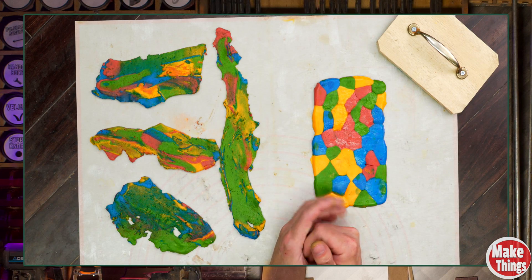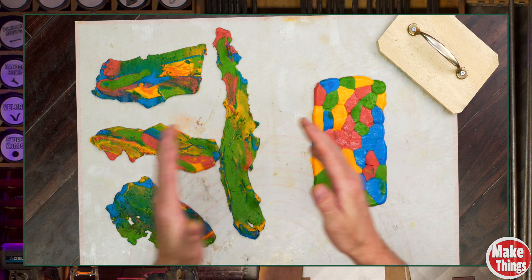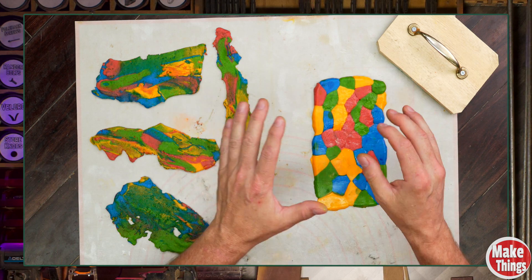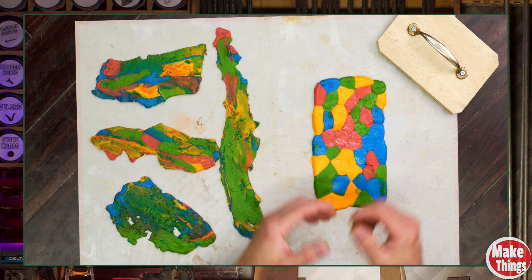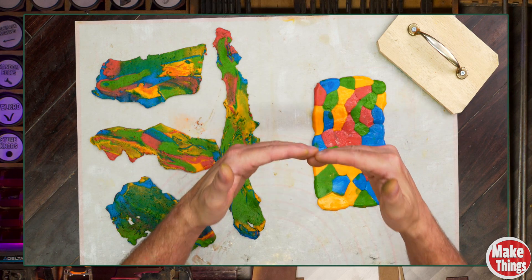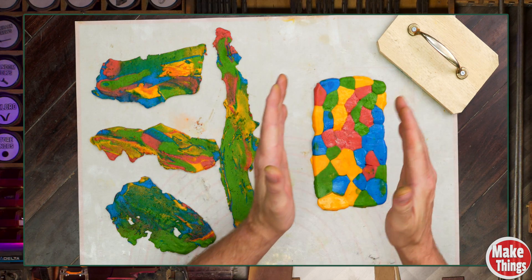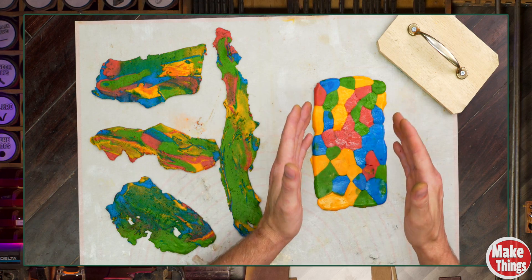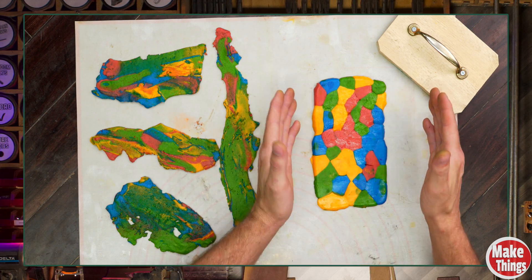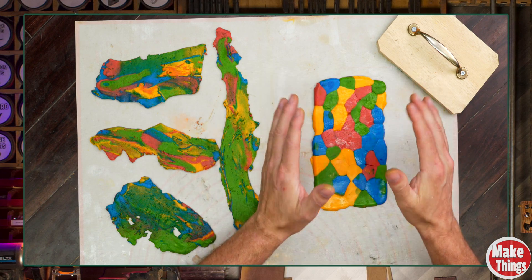But that does come with a trade-off. Cast being poured, not pressed, means you don't always get the perfect uniform thickness like you do with extruded. Say you ordered two pieces of cast acrylic thinking you'd butt them together for a seamless joint — you might end up with a visible step between them just because of the slight thickness difference. Another huge difference is that cast usually starts from virgin material: pure, fresh liquid acrylic mixed and cured from scratch. That's a huge reason why it's so dense and consistent.